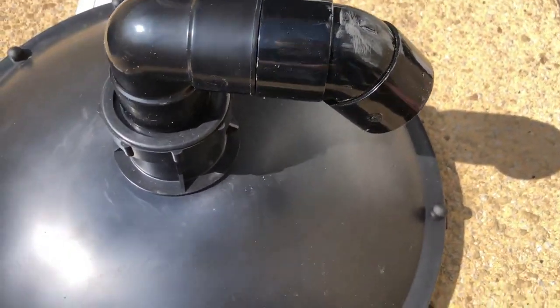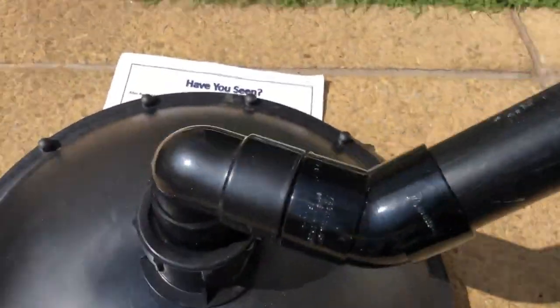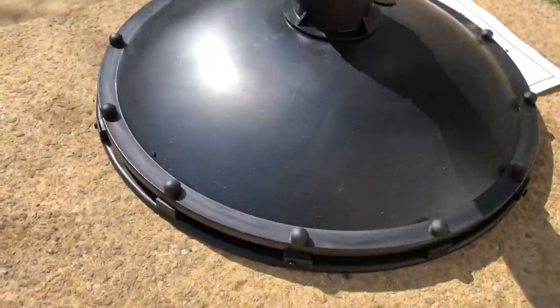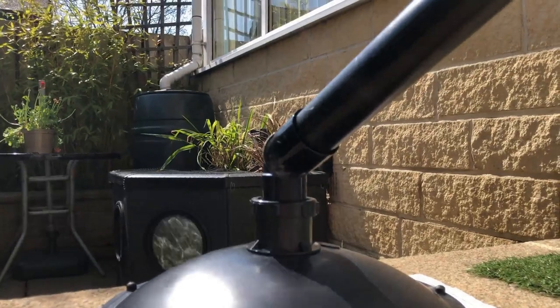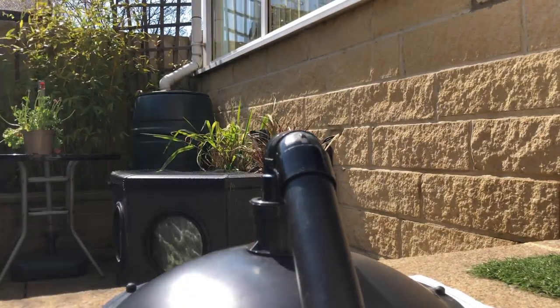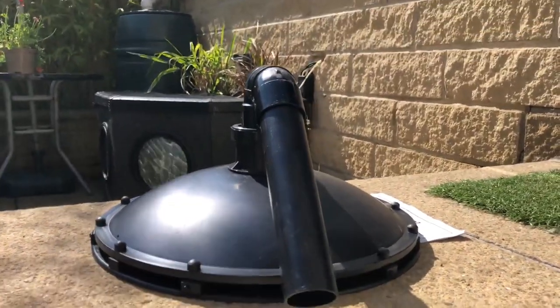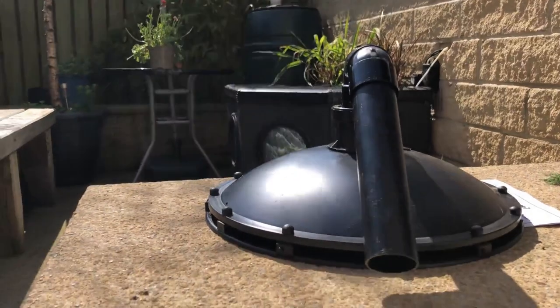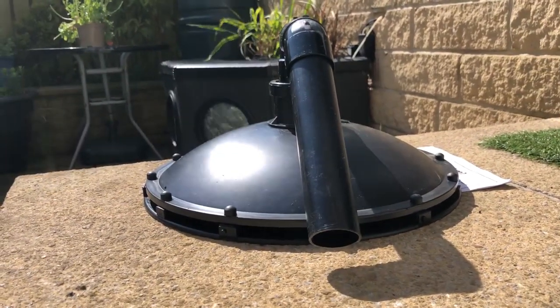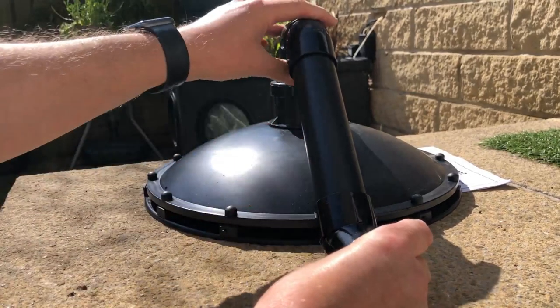So we've got that one on, and then we've got the next section of pipe trimmed and cut, so that will push into there. I can just make it a little easier, lift it up so I can get it in. See if we can get this on camera for you. And push that in there, and then that down into there. Which gives us this drop. And then all we need is a small little 45 again on the bottom. Solvent weld those together,